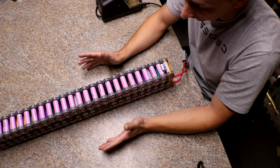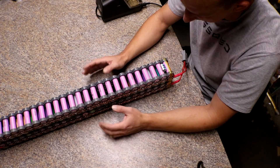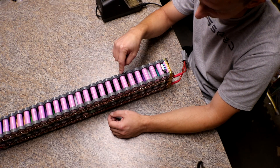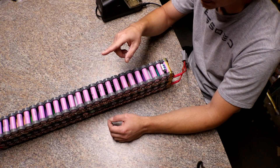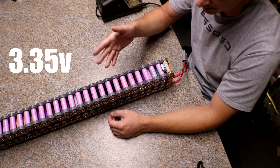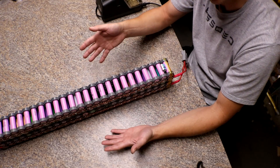When I got home I came down here and started checking each battery pack for the weak one — find out if there's any more issues. This one is the lowest one at 3.21 volts. I think I have another one that's like 3.27; all the rest are around 3.3 roughly. So I was going to pull the pack out and see if there's any more broken fuses.